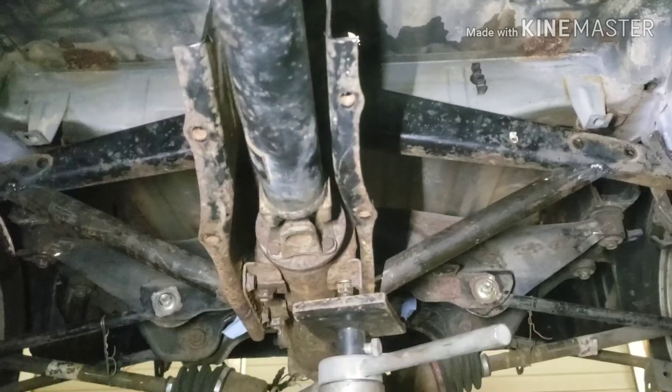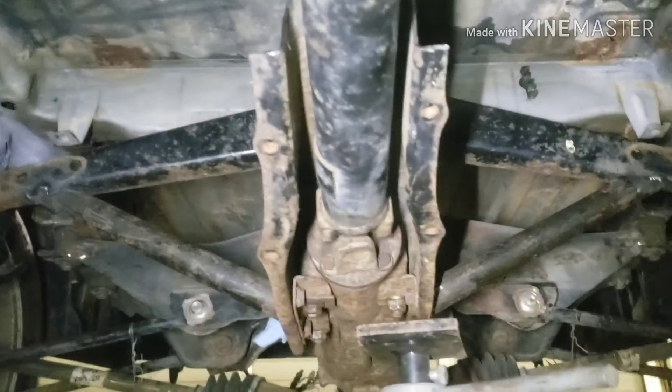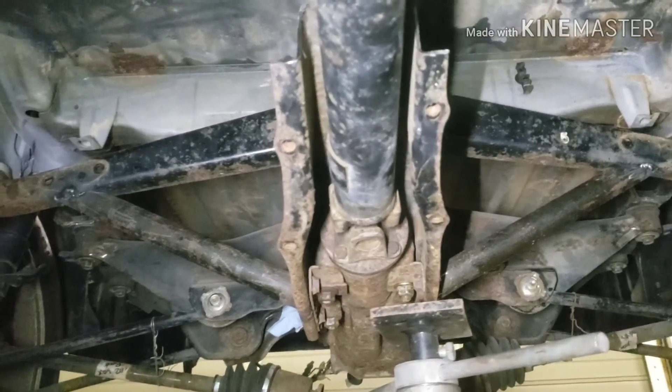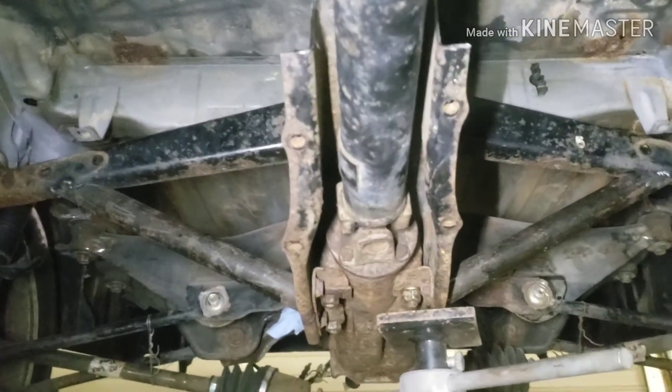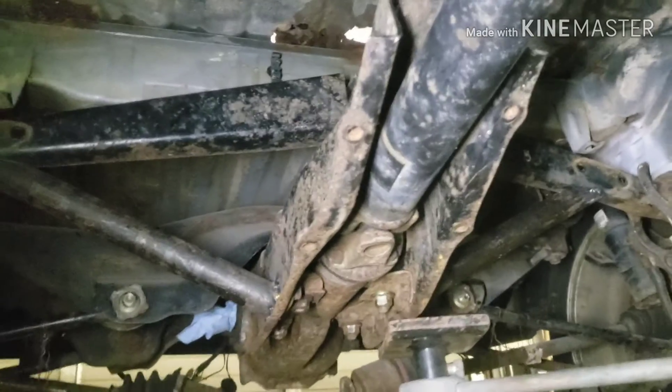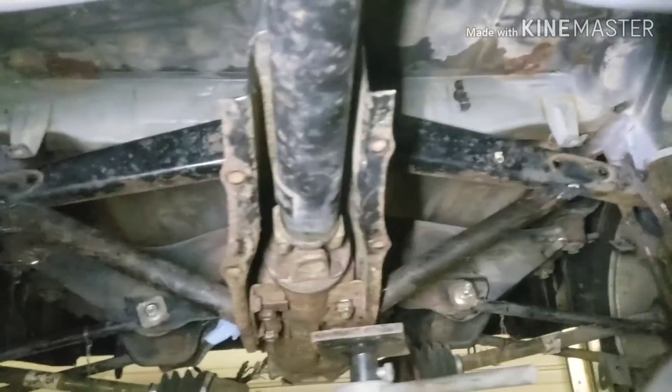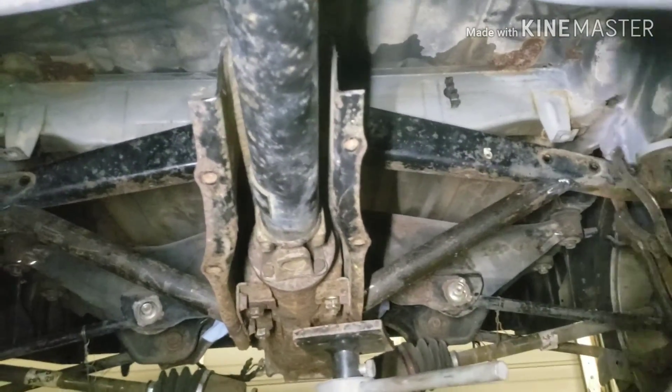I'm not going to launch it, I'm not going to bang gears. As long as this diff doesn't move and none of these welds break, there's no need to take it apart and fully weld it right now in my opinion. I'll see what my buddy thinks, but I don't think I'm going to twist anything if I get some more nice fat tacks on there.